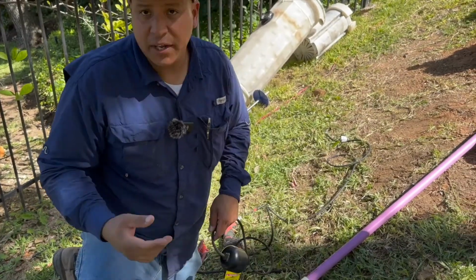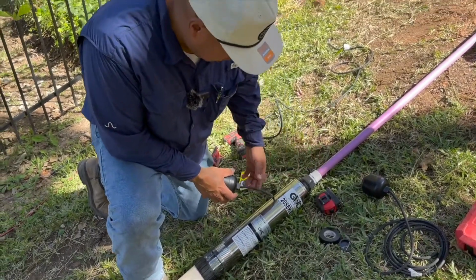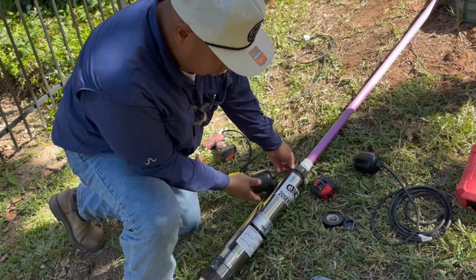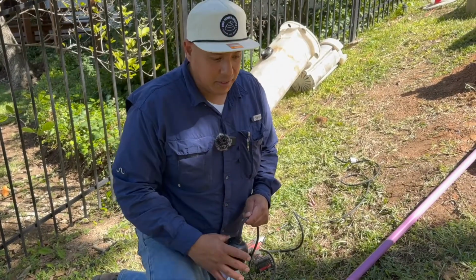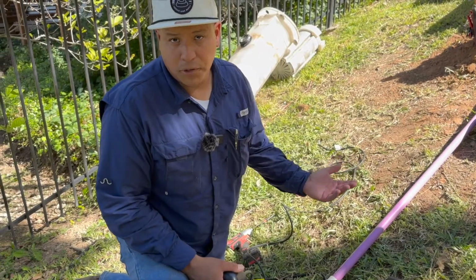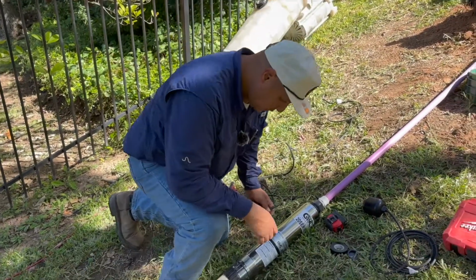But if you can pull plans, obviously try to pull plans and match it to what the plans specify. Because a lot of times you'll pull up these pumps and the floats will actually be affixed up here, which is okay. It's not going to affect anything. But because this one's a brand new one, they're going to inspect it. More than likely they'll ask us to pull out the pump during inspection, and they'll actually measure that the floats match the settings for the design.